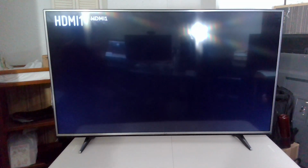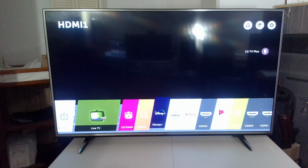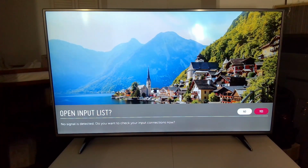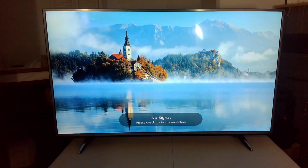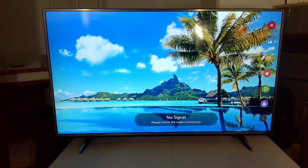And there we have it. So just a quick recap. The TV had half of it being dark, and the issue was mostly going to be targeted at the LED backlights. Now in my case, I was lucky enough the power board was good, so by testing the LEDs we realized that one of the LED strips was gone, and as you can see, after putting the replacement in, everything is back in working order. So I just put this video together to help anyone who may have such a similar issue.